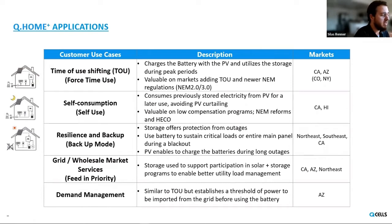The next mode is resilience backup — the explanation is in the name. In certain parts of the country, people want energy storage just so they can have the confidence they'll have energy when the grid goes down. During normal operation they don't care what their battery is doing — all they care about is that it's fully charged when the grid goes off. Backup mode will always prioritize keeping the battery fully charged so that if the grid goes out, your battery will have its maximum capacity to provide you with energy.